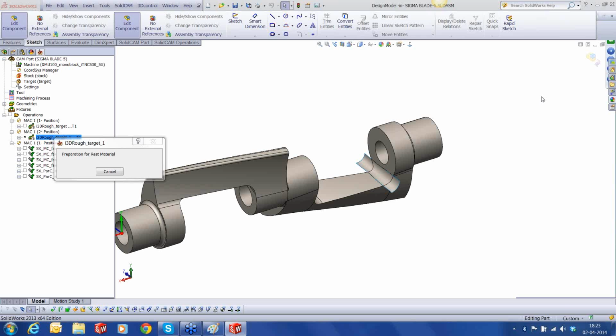In such cases, iMachining would not be recommended. iMachining would be recommended in parts up to about 500 millimeter, not 500 by 500, but let's say 500 by 200, or 250 by 250, 300 by 300. We are talking of parts moderate in that size. Complexity is not an issue. The size does become an issue because you're going to use a solid carbide end mill. And that was one of the reasons that made us use iMachining 3D for this particular part.